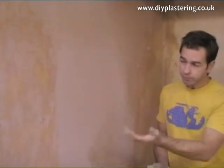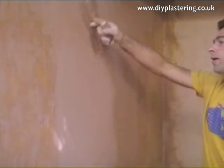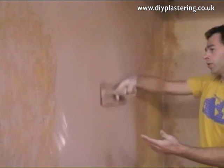When it's ready for stage five, basically the trowel marks come out. If they don't come out, it's probably just a bit too wet, so leave it a bit longer. Best thing is to take the trowel across and try it — if the marks easily come out, you're ready. If not, just leave it a bit longer. You can go over it another time if you need to, to sort any last blemishes out. That's a very quick rundown of plastering. Basically, don't aim for the results of stage six at stage one. You've got all those different stages and it gets easier. As the setting process starts to happen, you're able to achieve what you want more, as long as you control the suction.